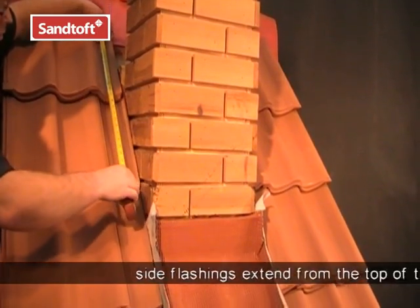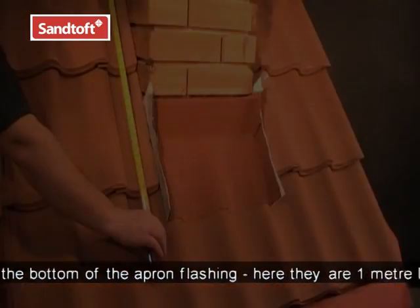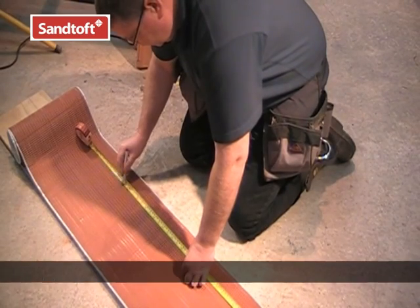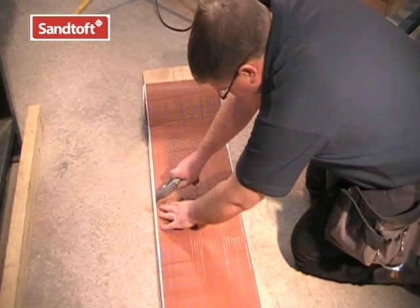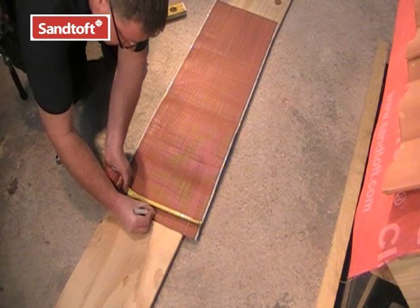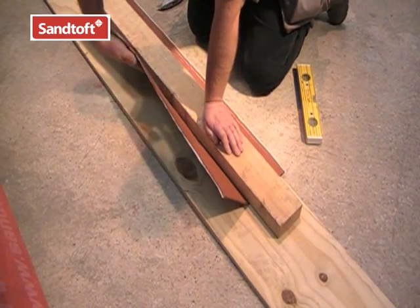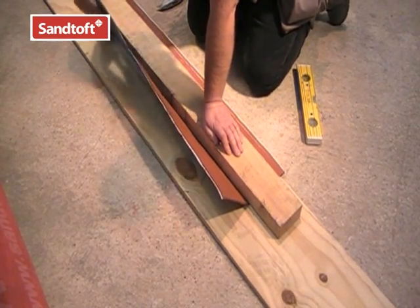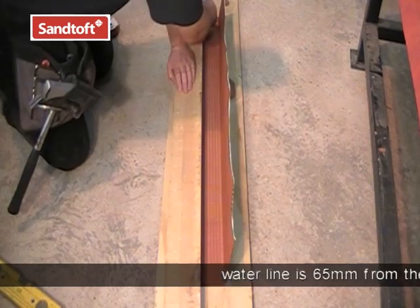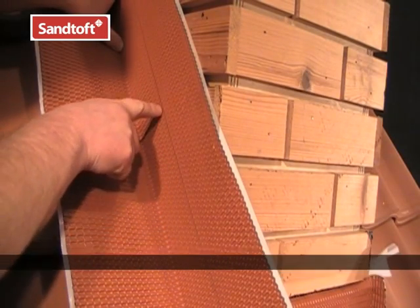Next, measure from the top end of the back gutter to the bottom edge of the apron flashing — in this case it is 1m. A length of Coraflex can now be measured and cut to this length. Marking and cutting on the top face makes it easier to follow the little corrugations. Next, we mark a centre line. The flashing can then be bent at 90 degrees along this line. Then we mark the water line, which needs to be 65mm from the bend. This will be the minimum height that the flashing extends up the wall.